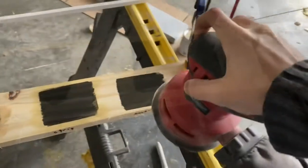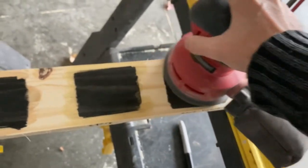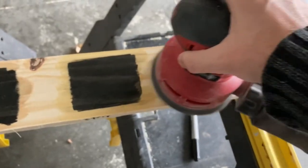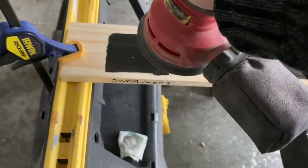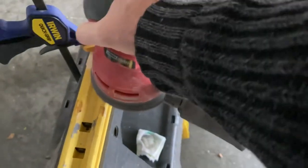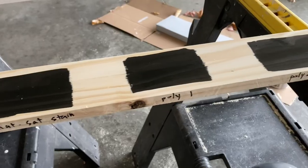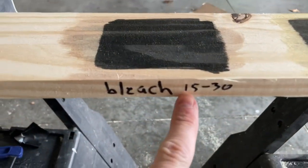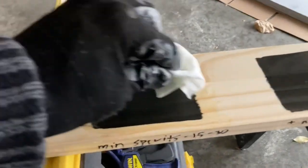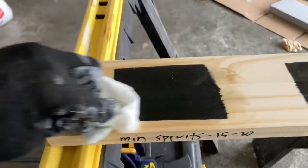I'll put links below for the different things I'm using. We're also doing a separate test scenario with a light grit sandpaper — labeling this 'light sanding' — with no pressure at all, just to see what it looks like. I also have a 60-grit sandpaper with a little pressure, labeled 'heavy sanding.' I'm timing everything at 15 minutes and 30 minutes. Your situation will be different depending on your stain color, but definitely put in time on your test process to make sure you get what you want.